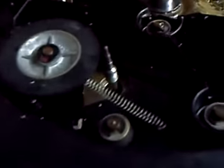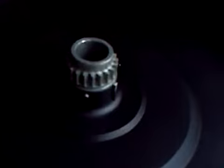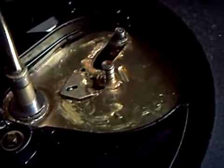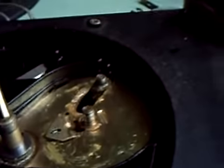The idler wheel simply runs on the inside of the turntable. Inside the turntable, on the boss, is the driving gear that turns the gear that does the auto-changer mechanism. On some later ones, they were plastic, and that wasn't so good, needless to say.